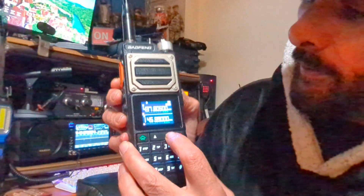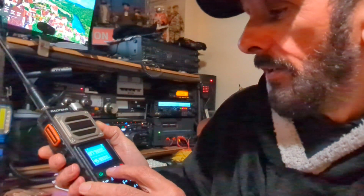I usually work it with a satellite array and a large antenna system, but you can actually receive the Space Station with a simple rubber duck antenna or this particular one, as we'll find out in a minute. So you want to start off by programming your radio — it's a UV-25 Pro in this case. On the screen you can see I've put some memory frequencies in there. I've programmed in basically 437.810 right down to 437.790 — so that's 790, 795, 800, 805, and 810. That's 437 MHz. I've pre-programmed them into the memory slot, which makes channel changing simple.